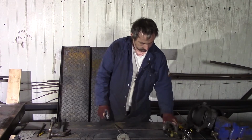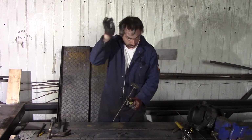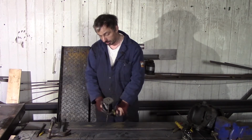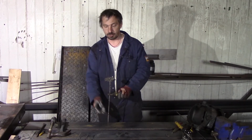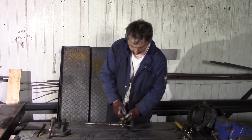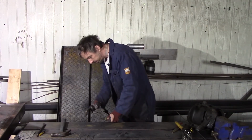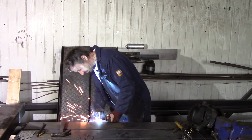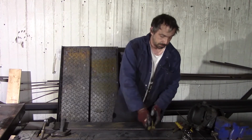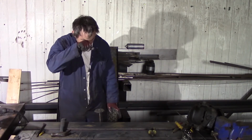How do I do all the next things? I just take this rose and my choice is to weld it somewhere to the table where it stays very stable, and after that I can cut off. Don't weld too high, because we need to bend these leaves, and it all the time tries to bend and it's very, very hard to get a good shape. That means I do it approximately 10 centimeters from the surface, just on two spots. After that we cut off, pre-grind and it's fine. Okay, that's one thing.